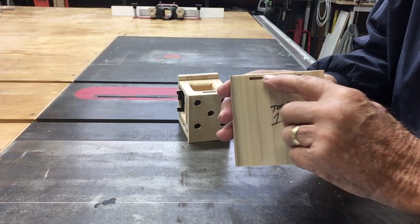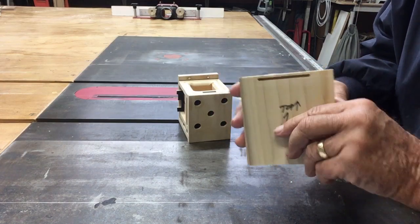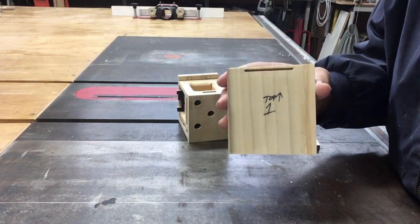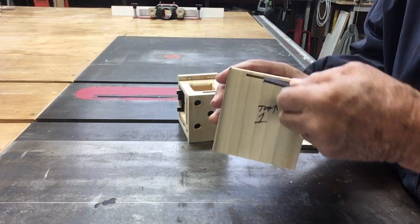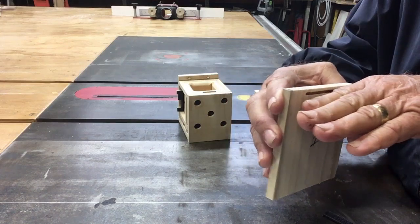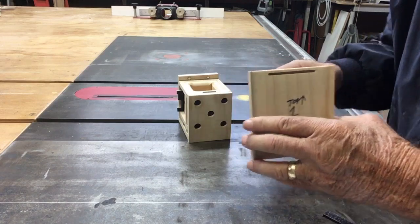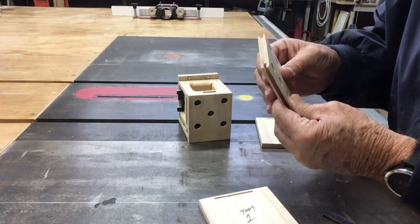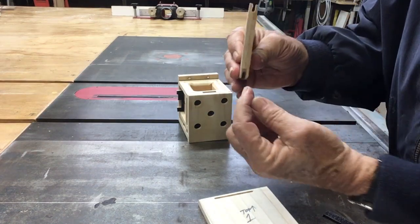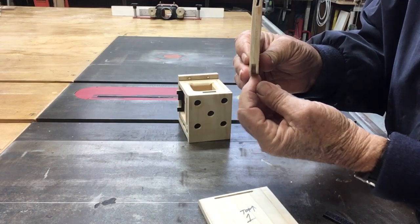And when you do this one on your side number 1 and number 4, this is a 1/8 inch straight bit. A little smaller than the 3/16, because what happens is when you try to put your piece in there, if you go 3/16, it's gonna be sloppy. It's going to be hard to keep it at 90 degrees. So change your bits, make it 1/8. And when you set it up, you set your 1/8 bit to put this piece back on your fence. Set the 1/8 inch to fit right dead center of your 3/16 if you can.